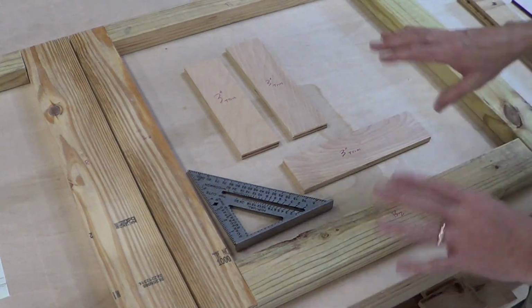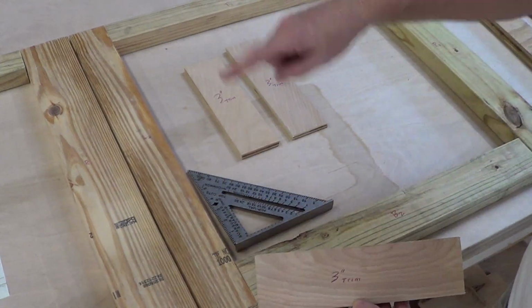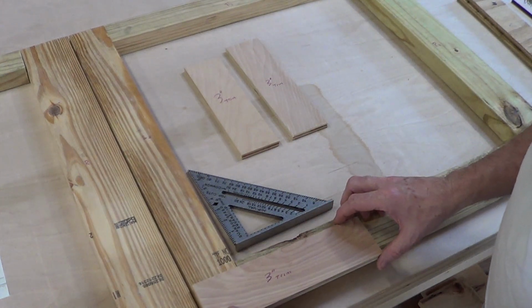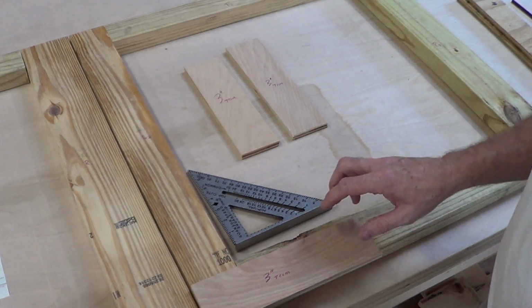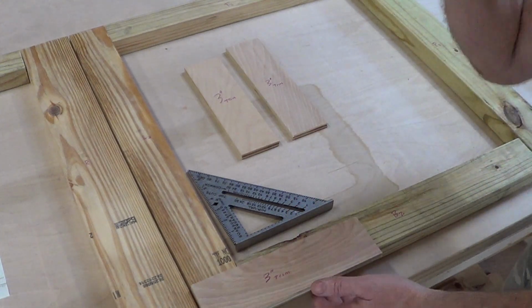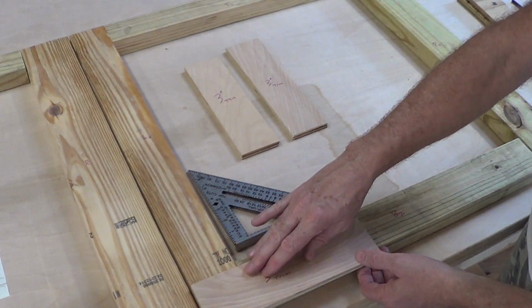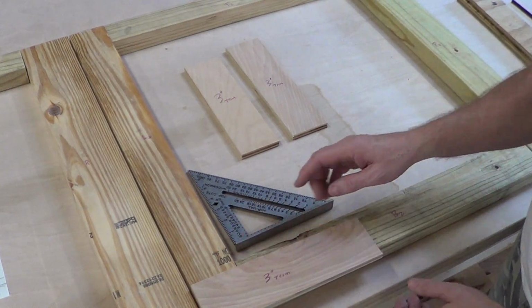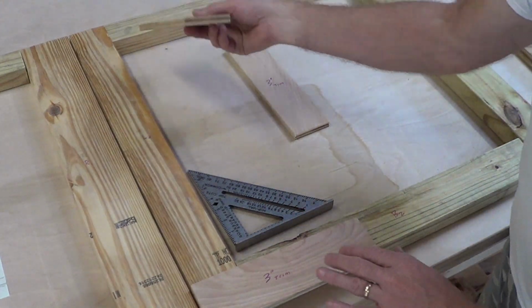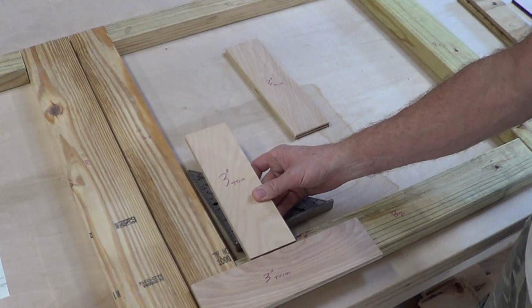All right, imagine now that I've got it sheeted. Okay, and we're going to come along with our 3-inch trim. It's going to go all the way around to be uniform. I'll show you how this is going to work out. All right, so the first one you can see is going to overhang on this side. That's because this door closes from the right, and this will catch up against the coop. That's like the stop for the big door. On the inside, you have a little space for the door that hinges at the top and comes down and stops up against that.